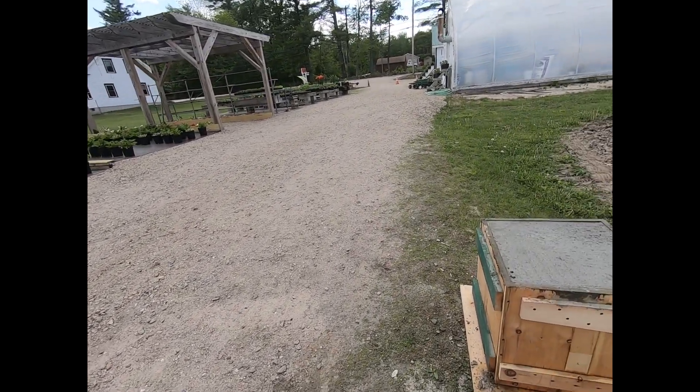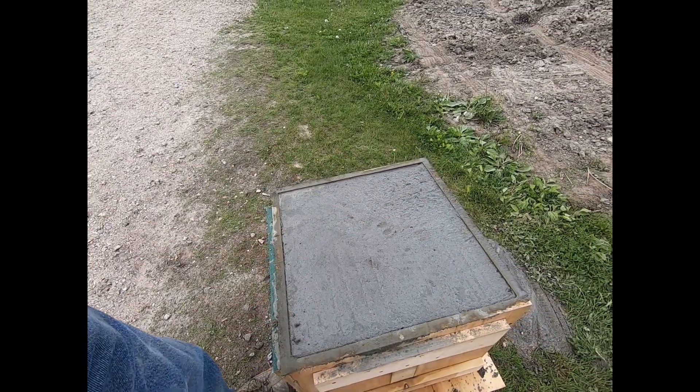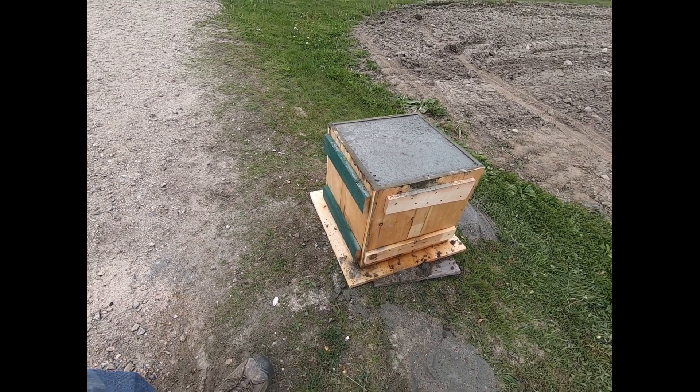Carol's been doing a little bit of landscaping. The stuff's almost set — it's not set enough to take the forms off, but it's finally so you can put your hand on it. This right here is what we ended up with. It settled a little bit because it's quite a ways down through it. There's about six shovelfuls of cement and thirteen shovelfuls of sand — about one to three mix.